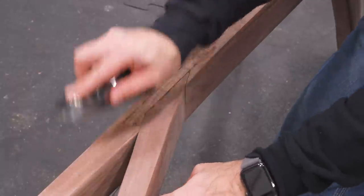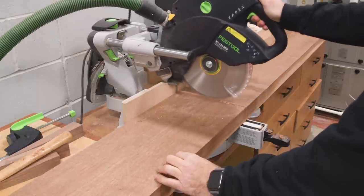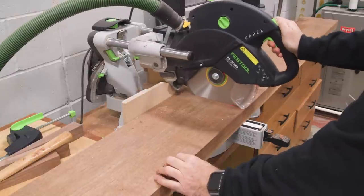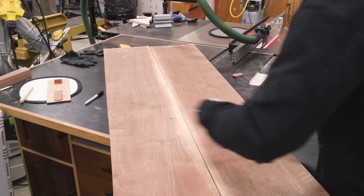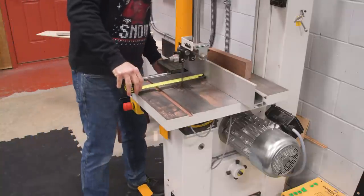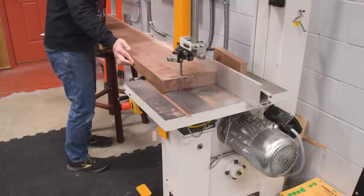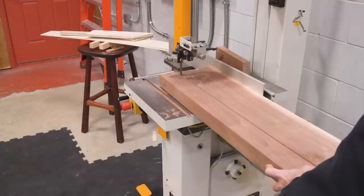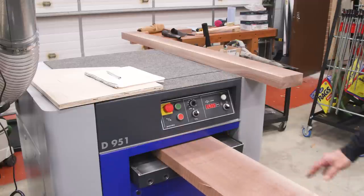The next day, the splines are cleaned up and sanded smooth and it's time for the seat. If you have stock wide enough, you can make the entire top from one single piece. But I decided to make the top in two parts — one lower section as the main part of the seat, and a wider section at the back that features a slight taper angle. The idea being that it's something that not only looks cool, but also tells your butt that you're at the back of the seat. Not that I've ever fallen off a bench — at least not sober — but I expect people might, especially tiny humans that don't pay attention to what they're doing.